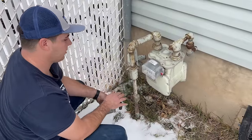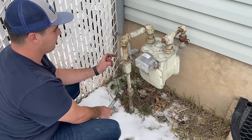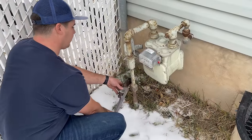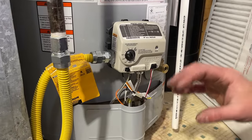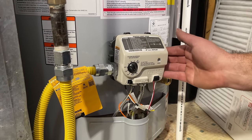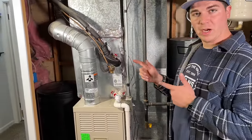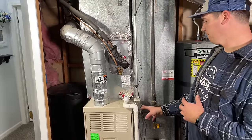One thing to note when you go to turn the gas back on is you want to avoid doing this too fast and hearing the diaphragm shut, because you could actually damage the diaphragm inside. So we're just going to do this real slow until that tab is parallel just like it was when we turned it off. When we turn the gas back on, we want to relight our water heater. If you're not sure how to do that, look at some of my other furnace replacement videos. Now let's go ahead and shut off our power at the breaker box — we never want to trust that the switch is fully turning the power off.